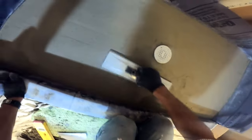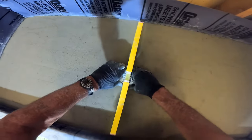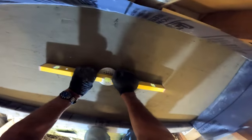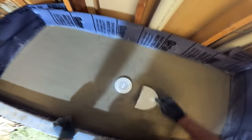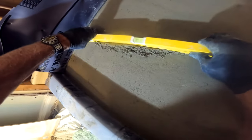For mortar, I don't suggest homeowners do a dry pack — make it a little richer, not so dry. The mortar product I used here is a Home Depot Quikrete product: the yellow bag with the green stripe. With that one, the next day you can still manipulate it — take a 9-inch blade and cut off high spots. The yellow bag with the red stripe you cannot manipulate the next day; it's a richer mix. If you shop at Lowe's, I love Sacrete Sand Mix — the aggregate is thicker and easier to work with. If I had my choice for every shower pan I'd use Sacrete over Quikrete.